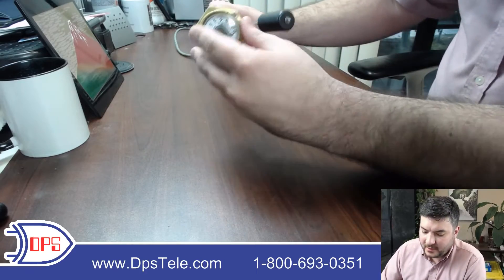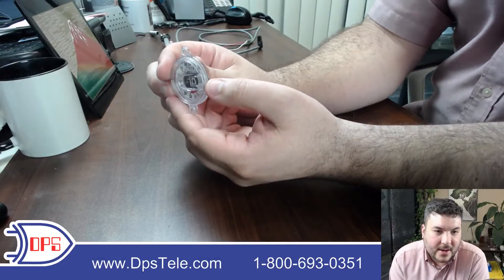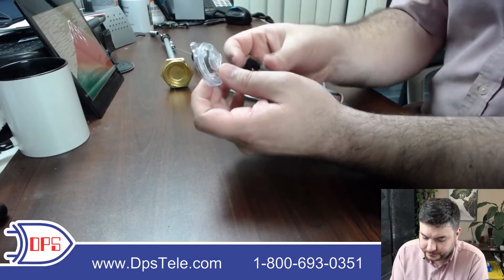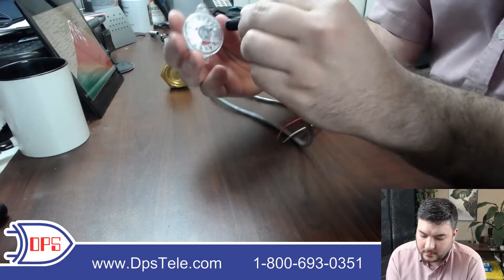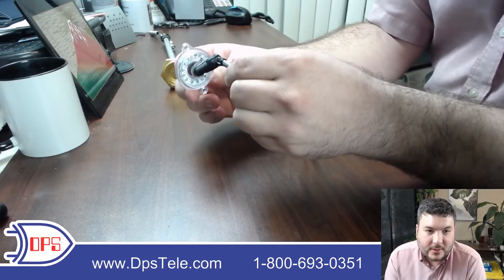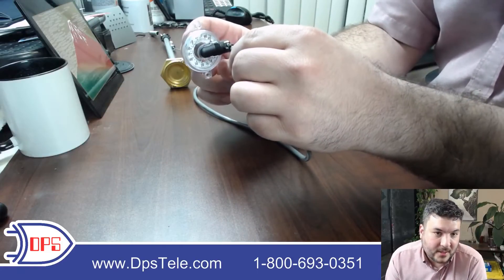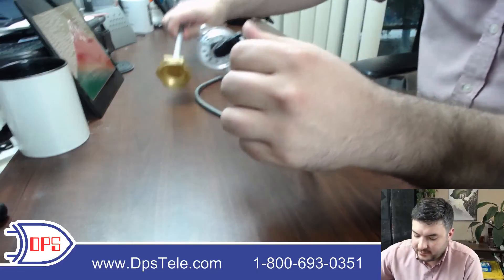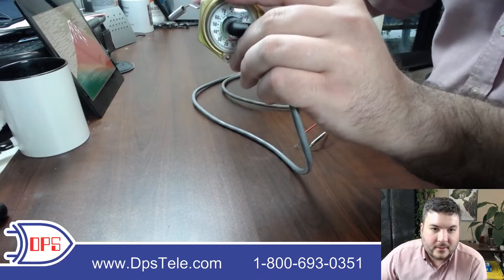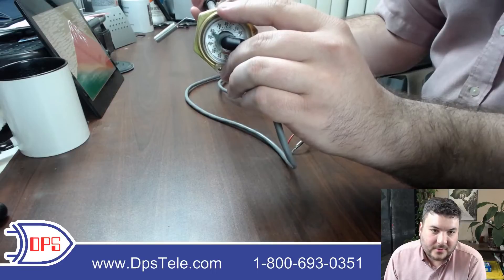This gauge in particular can be used in this configuration, but that's a bit of a waste because it's what's called R3D ready. You can see it's got this little cutout in the faceplate — that's a standard that accepts an R3D sensor. We'll slide that in and it just clicks in. Once I've done that, it will now pick up the level of the needle, and you can see it keeps itself clear visually, so you can still read the needle if you're out at the site. As the level goes up and down, the magnet causes the needle to rotate and is also picked up by the sensor.